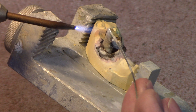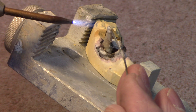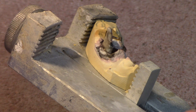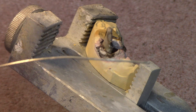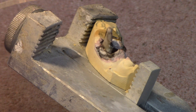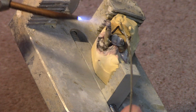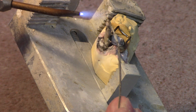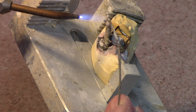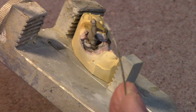So just an exercise here to see how far I can build this up. When you're learning how to solder, heat control is one of the big deals, and this is a good way to practice it. I'll put flux on my solder every now and then — it just kind of helps it out. You can see I'm building it up fairly tall. That black on there? That's from the brush — I melted some of the brush on there, so that's a contaminant. You don't want that in your solder joint, but let's see if I can solder it anyway. Okay, pull that off.